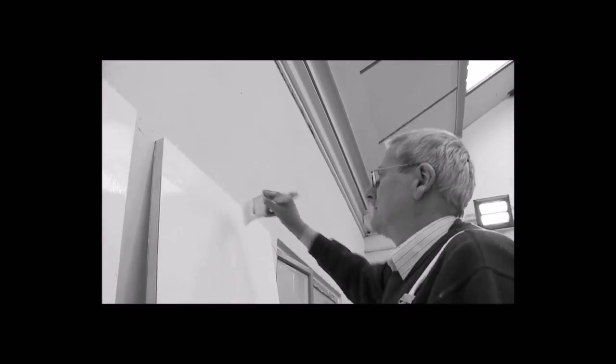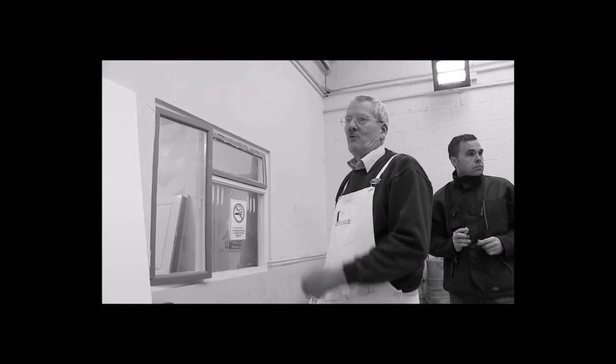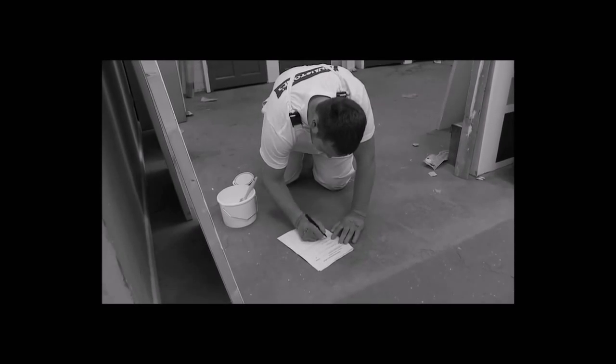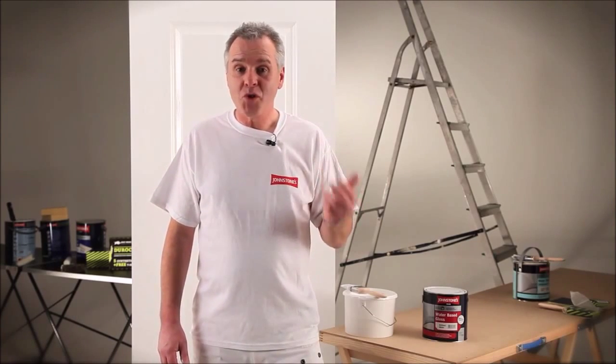You can believe me, that's the best one I've used for a while. It dries quick, there's no smell. You've got your oil-based paints that everybody complains about — in hospitals you can't use them now. And it's the whiteness — it stays white, so you don't get the yellowing that you get with the old solvents. When it first started I wasn't keen on them, but then we did trials for all of them and Johnstone's came out on top. The application of the Johnstone's new improved water-based Aqua system is really impressive — it feels so much more like the solvent-based glosses we've been used to. Why don't you give it a go? I'm sure you won't be disappointed.